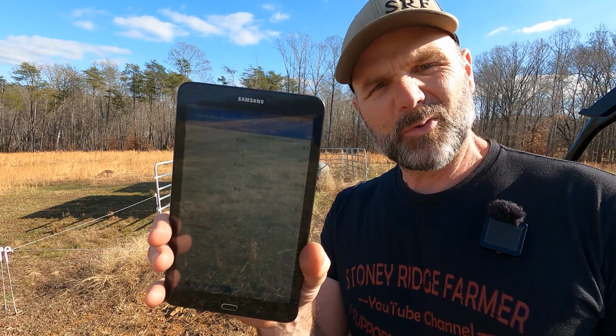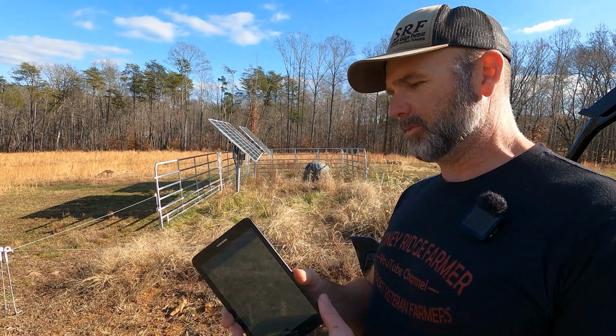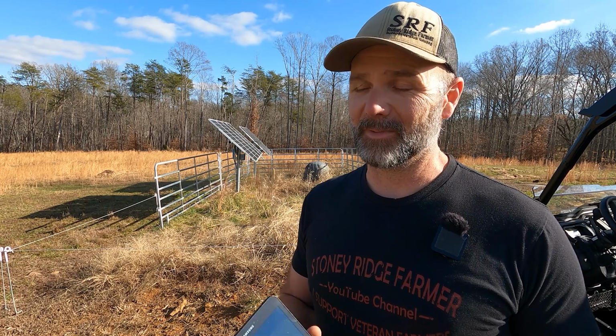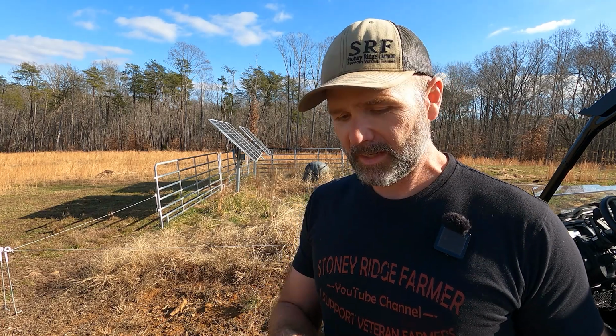So 4.4, 4.6 gallons per minute. We will fill the entire water system back up since it ran completely dry. Now what you need to know is if you have several cloudy days, you're gonna have to have a backup water tank supply and or a backup power supply for your solar well.